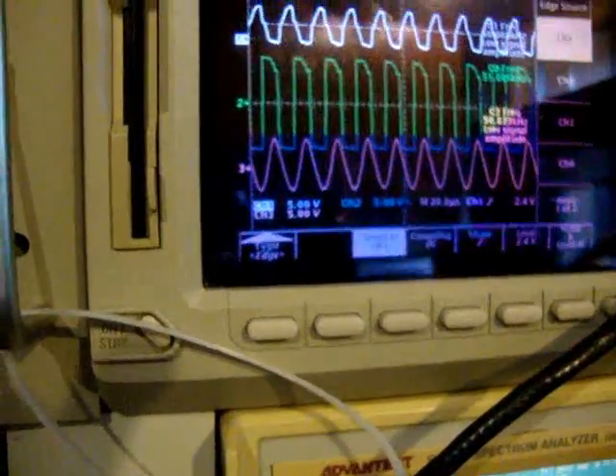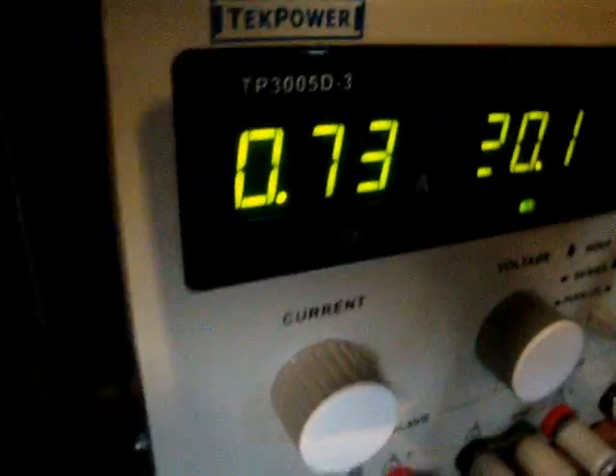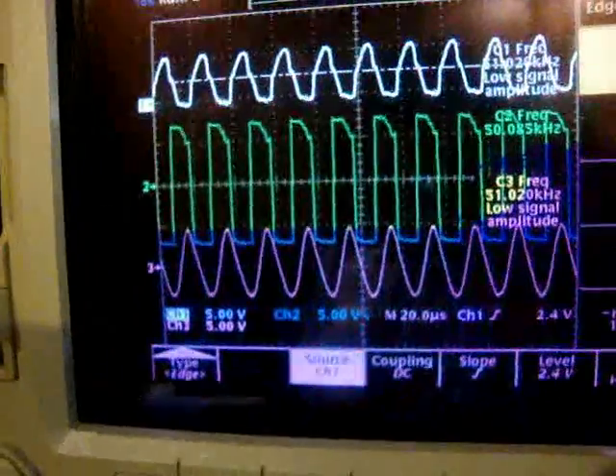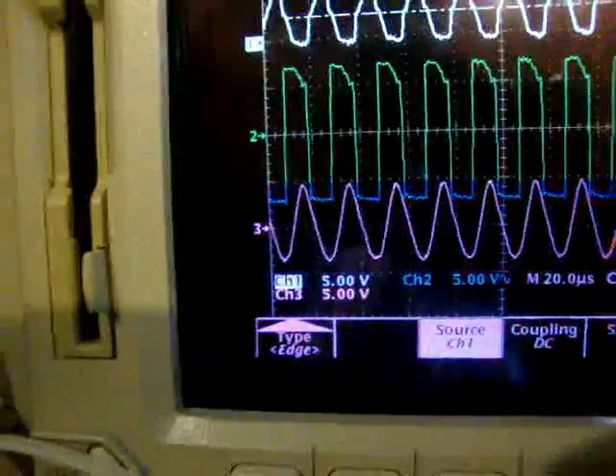Wow — 0.74 amps! The voltage is 20 volts, I didn't touch it. All I did was change the resonance frequency. So by changing the resonance frequency I'm getting approximately similar voltage but the current is much smaller. This high voltage wire is now at 10,000 volts.